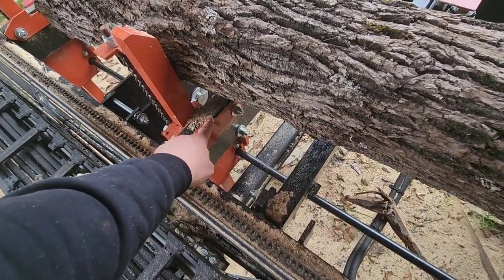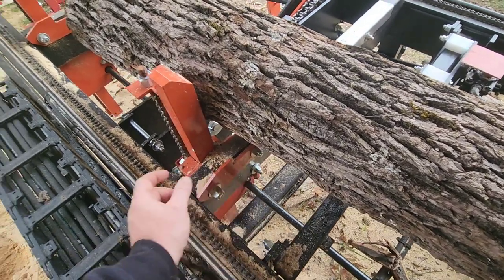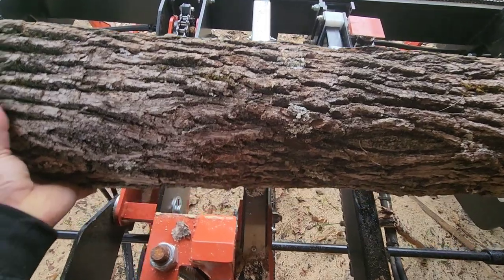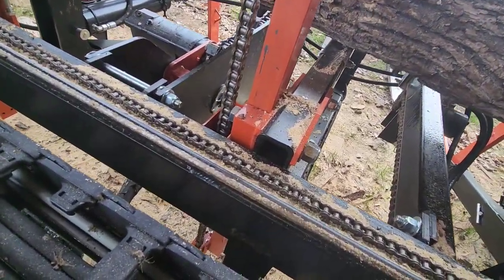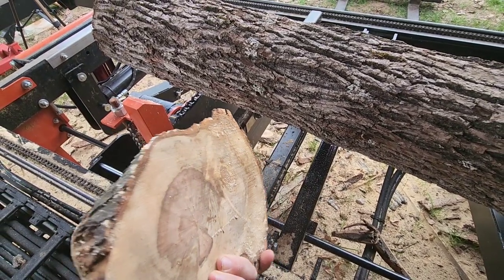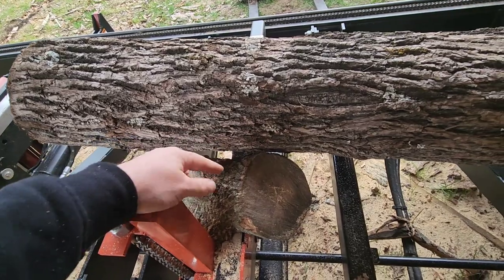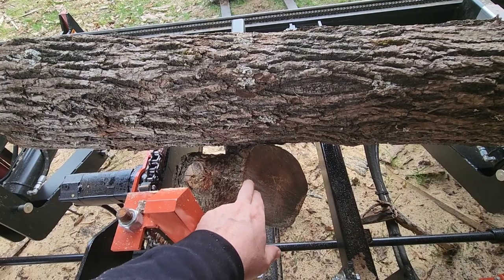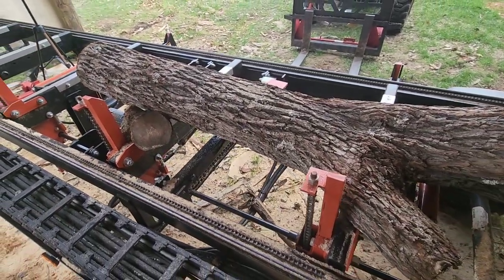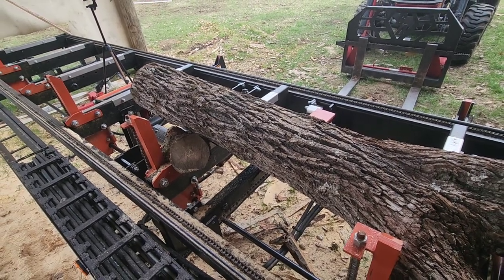At some point I'll be at the extremity there. So what I like to do — if I had to make a mantle or something — the good thing is we have a sawmill and typically have a lot of debris and off-cuts sitting around. So I'll go ahead and put this maple piece in here and make sure it's secured. You want something you don't care too much about because sometimes this does become a sacrificial piece. So now I've got that pinned over, the log is in about the orientation I want, it's secured, and all I have to do is bring in my log dog and dog it in.